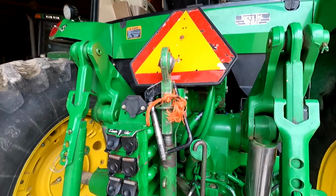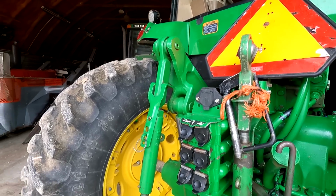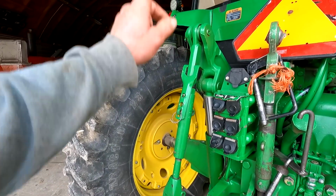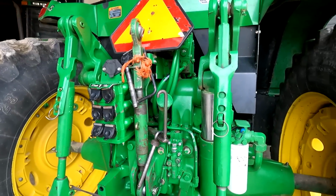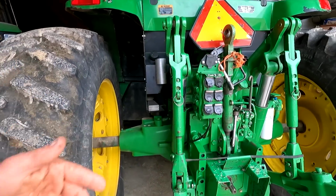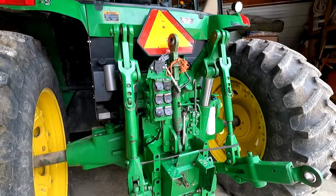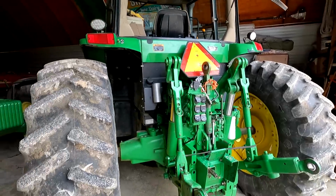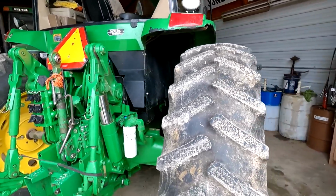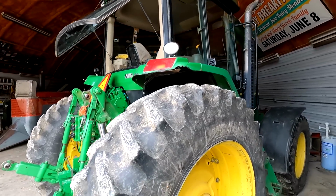And then the last hay I cut, we had a leak in the hose for the disc bine. And so then when I would use the hydraulics, right about in here where that leak was, a mist of oil would shoot up into the air, and everything back here got oil on it. Just a mist after cutting for a few hours, and then the dust, you know, the dust likes to stick to oil. So it didn't really hurt anything, but it just made everything look nasty. The back window and everything. Until you actually really scrub it down, even though you wipe it off, the oil never really quite goes away.